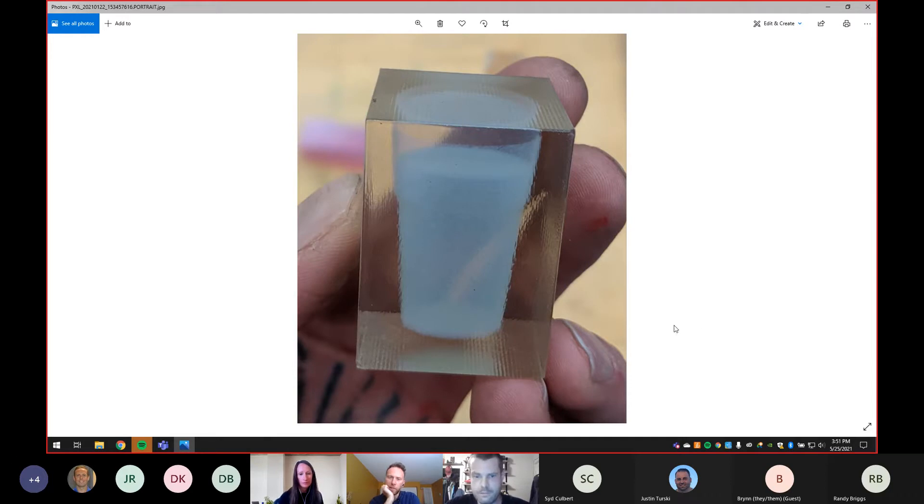Adam can show a lens he really polished to crystal clear. You can see the jetting lines from the print head on the top and bottom surfaces. When thinking about transparency, any jagged surface on an object trying to achieve transparency will refract light and create a more blurred effect — which is what we're seeing here. It's an interesting process to finish these pieces to make them truly transparent, and Tom is looking forward to making more attempts.